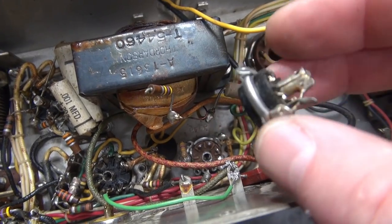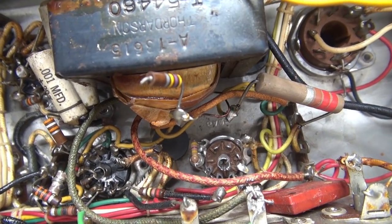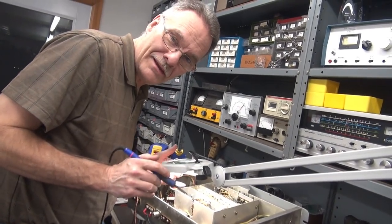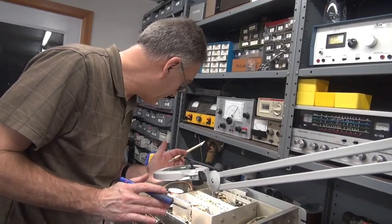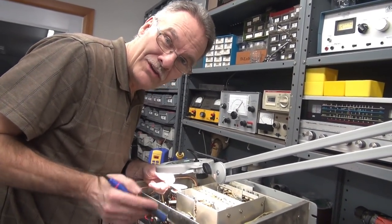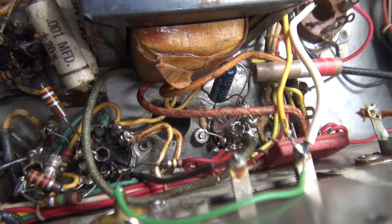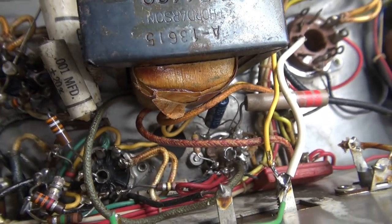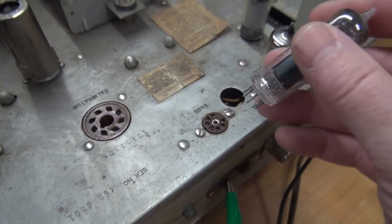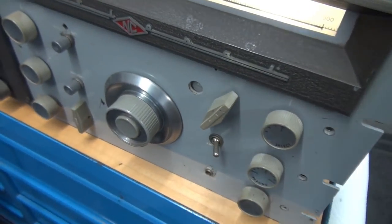I've got the new socket in place. I prepped the new socket with the resistor and the ground runners and just need to get in here with tweezers and hook up everything else. When I'm doing this kind of work, to me it's brain surgery — I usually have some music going, a hidden glass of wine, doing all this work with my soldering iron, X-Acto knife, and tweezers. That's why you should pay D-Lab more money — I'm torturing myself for you guys. There's the new 6AQ5 socket installed. So the next question is, do we have any audio?